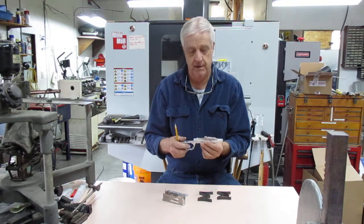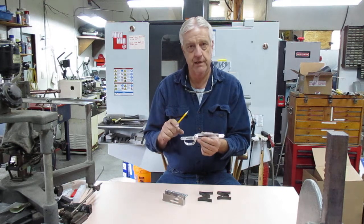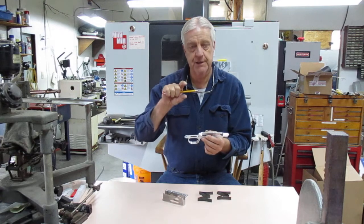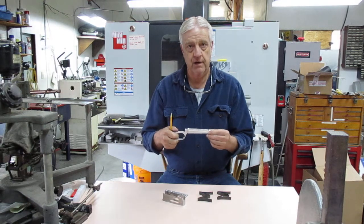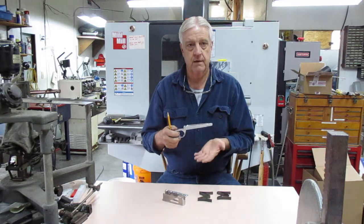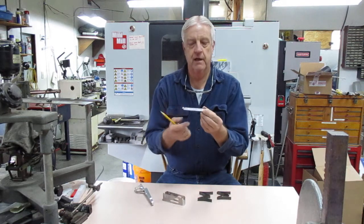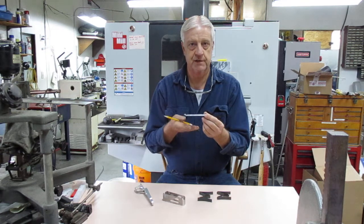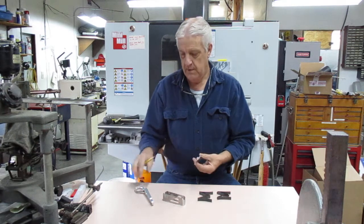that 3rd round down. If you don't get the 3rd round down, then there's a good possibility that the pillar height on the stock is too short. So the whole stock, the dimensions are a little bit too short through the center. If that's the case, then your only alternative would be to go to like a PTG, what they call a canoe style floor plate. On the canoe style floor plate, the floor plate actually drops down about, I don't know, 1/8 of an inch, 3/16 of an inch below the bottom line of the stock. So it allows you a little bit more room in there.